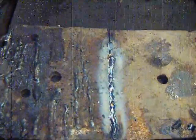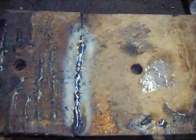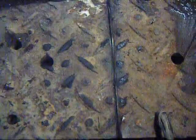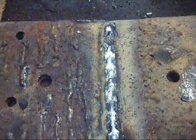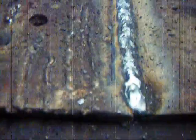Trade school now for welding, but I ain't done. Gotta do both sides. Cut a little trench down to there. You can't really see it, but it gives your weld a place to go. Ended up doing a three weld pass on it. I think it looks pretty good, but you know. Repeat my work, please. I want to get better.